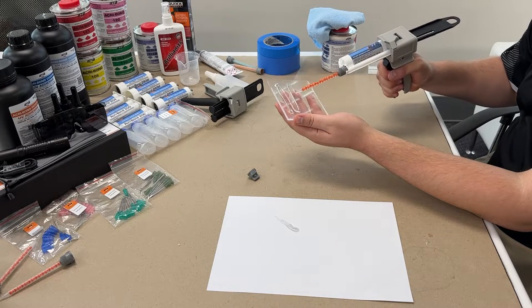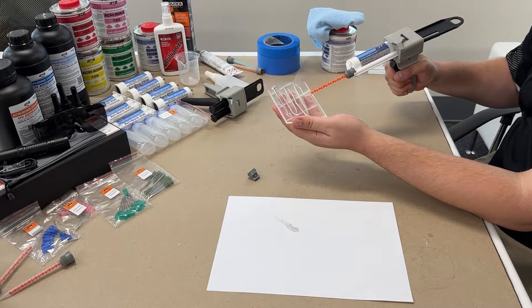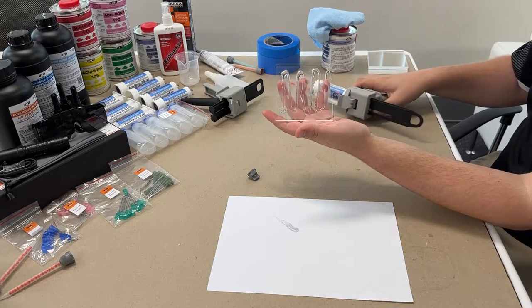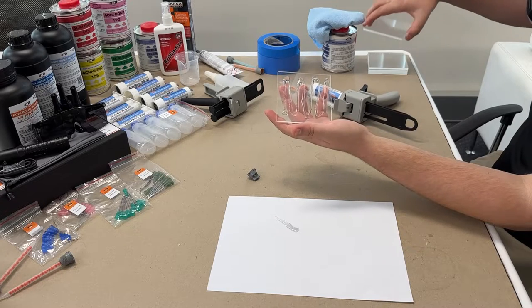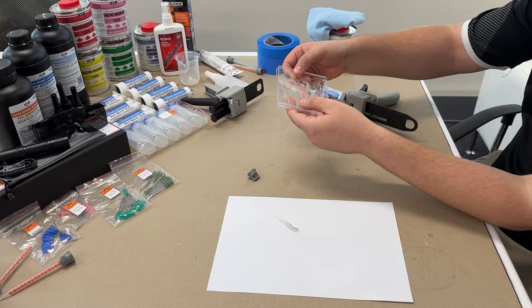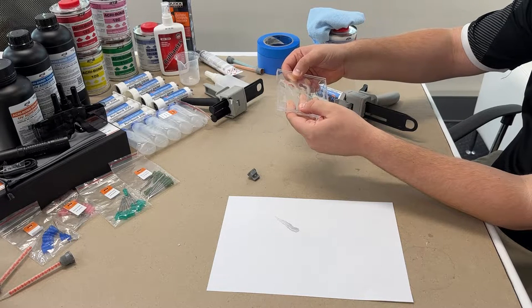To show the flow of the glue, we have done a worm on some acrylic and bonded it. With a light press, it bonds it together. Be sure to leave some light weight on the surface to hold it there until the glue has set. The glue has about 8 to 10 minutes before it sets, so there is sufficient working time with the product.